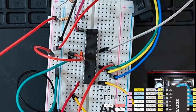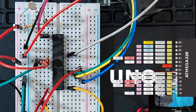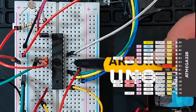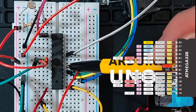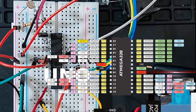And I want you to remember that. That took me a while to figure out. And if you have servos that are jittery and stuff like that, that could be one of the reasons why. You could also put one of these capacitors over on this side, and to balance it out, you put it on the ground rail and the voltage rail. So you'd bridge it here and here. You'd have these two. This is voltage reference.